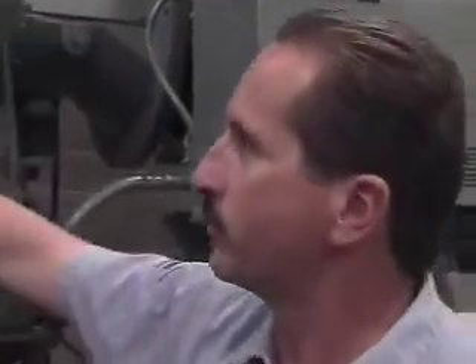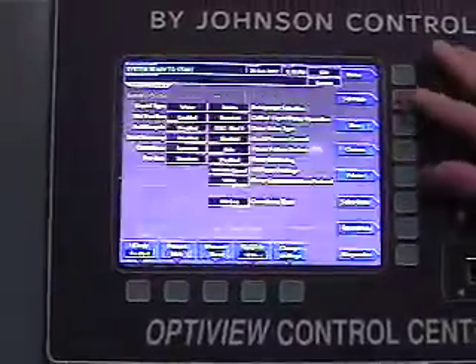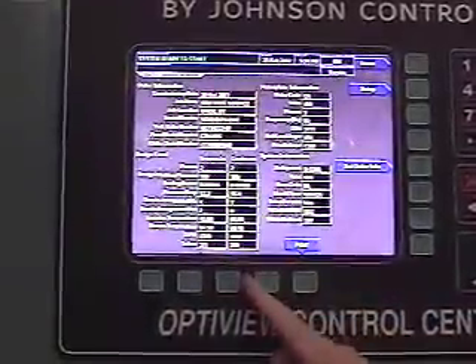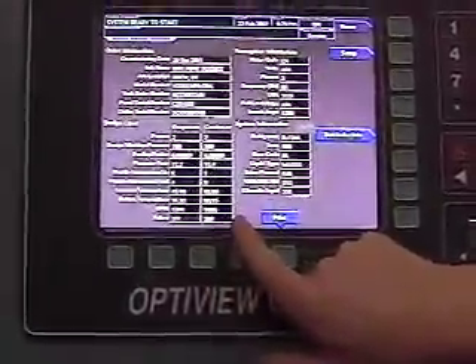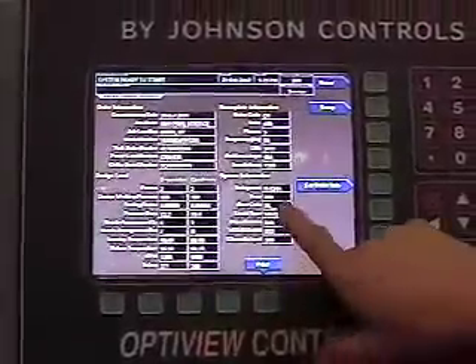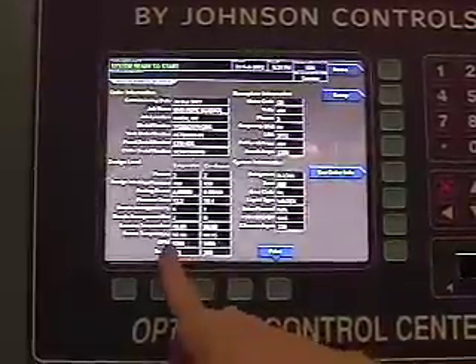If you pull up the panel, it has several screens. Right now we'll go to the sales order screen, which gives you all pertinent information regarding this chiller — temperatures in and out of the evaporator and condenser, and the required gallons per minute. These are all conditions that must be met to deliver the 600 tons of capacity this machine is designed for. Going outside these parameters means you lose the kilowatts-per-ton efficiency the machine is designed to provide.